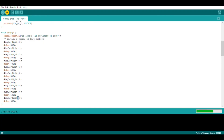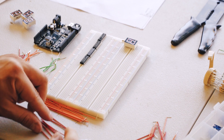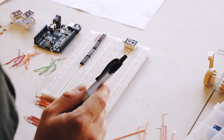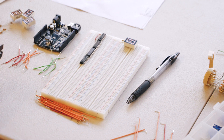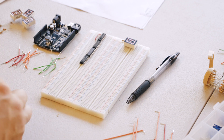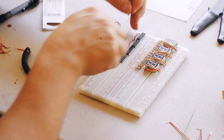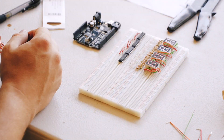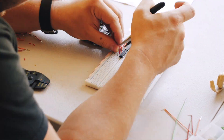Now compile and upload the code to the Arduino. And it works! This might take you a few tries to get right — I had quite a time debugging between software and hardware before it worked, so be prepared. Hooking up 11 Arduino outputs to 4 7447 chips and 4 seven segment displays takes over 50 wires. This quickly becomes a mess — this project really needs a custom PCB, but that's a project for another time. To tame the mess, I recommend planning your connections and measuring them so you can cut the wires to the right size. Having random lengths of wires sticking up everywhere is a nightmare to debug, so wiring will be easier to troubleshoot if you do it cleanly.